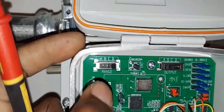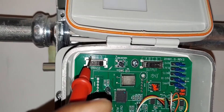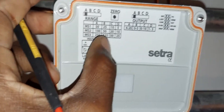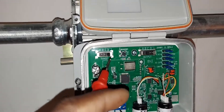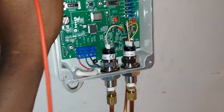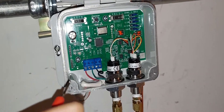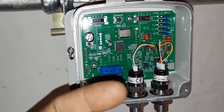These settings A, B, C, D are your pressure ranges. Setting A and B cover 50 to 250 PSI, and 25 to 125 PSI, and so on. Based on your application, you use the selector switch to choose. In my case I have 50 and 60 PSI, but this chiller requires a feedback voltage above 1.5V to show flow proof. That's the reason I have my settings on D — to get a higher feedback voltage out.